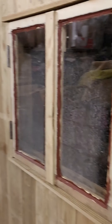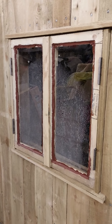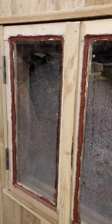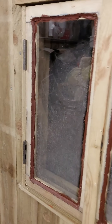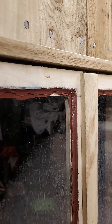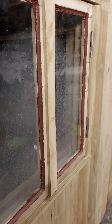The other bit of progress was putting these windows in. They're actually not glass — it's not even perspex, it's something like acrylic. It's easy to work with; just cut it on the circular saw. It's put in with a mastic frame sealing mastic. Once that's gone off properly I'll tidy it up, but I don't mind it looking a bit rough because it's in keeping, and that's my excuse and I'm staying with it.